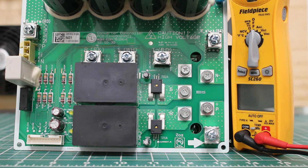So we're going to check between P and R, P and S, and P and T. Then we're going to switch our leads and keep our red lead on negative. From negative, we're going to check between R, S, T as well with the black on R, S, T. So N to R, N to S, and N to T.